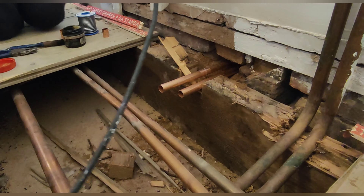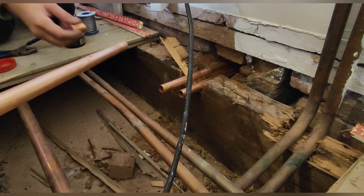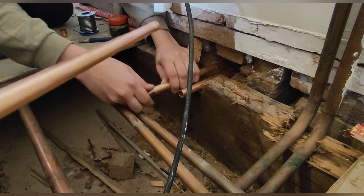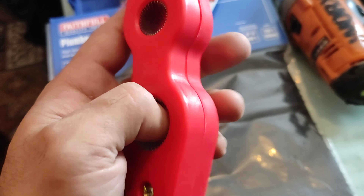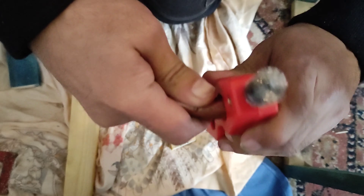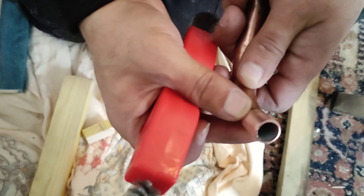I've separated the pipes so that when I heat one it doesn't affect the second. Adding a bit of flux - flux helps the solder flow around - and make sure the pipes are clean using a wire wool brush. You add the copper pipe join section and then heat it and add the solder. Sometimes the lead joins might not fit straight away, meaning the pipe isn't round or hasn't been cut properly. I've got one of these tools that rounds off and cleans 15mm pipe - you spin it around a couple of times. See how nice and shiny that pipe becomes - it cleans it and allows a smooth join. You can also deburr with this. I found this worked quite well; you can get it on Amazon for about five or six quid.